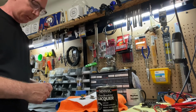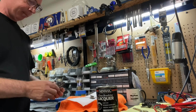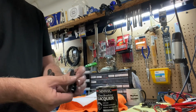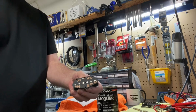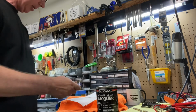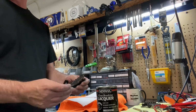Today I will be doing some winding, but first I'm working on our friend's Road Worn Telly, and I am winding a custom set of pickups for him. Single coils. I just put together the bobbins this morning. On these bobbins, I'm using A5 Alnico 5 magnets in the bass strings and Alnico 2 in the treble strings. Doing that on both pickups, and seem to have just great sounds coming out of these. But this will be custom wound for him.